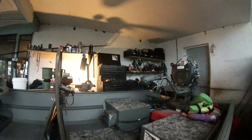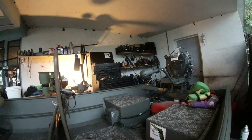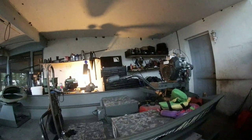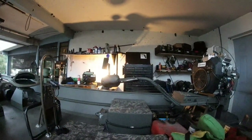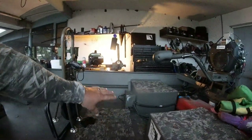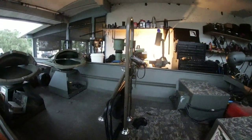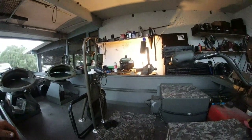I'm running a modified Predator 670 surface drive. The surface drive is actually made by Gator Tail. I just stripped it down to direct drive, no reverse, nothing. Try to keep things light and simple so nothing breaks. I got it wired up decently clean. I didn't want to put extra holes in it or cut anything that would possibly get moved later on. So I put everything in kind of a conduit box and bolted it to it.